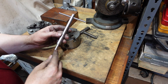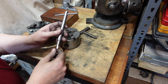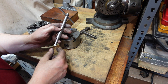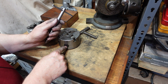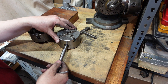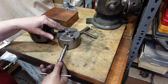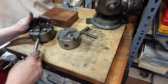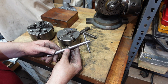As you saw, once the bolt was in and down to size I put the flats on, put the crossbar through, and did up the grub screw. I had to give it a little bit of a touch with the angle grinder - I think it's because the corners in the socket aren't as sharp as they could be - but a bit of work on the corners and it fits that one, and more importantly it fits this one, because this is the one I use quite a bit. So thanks for watching, and stay for the next one.